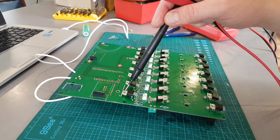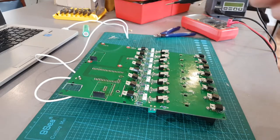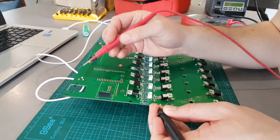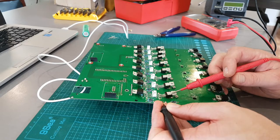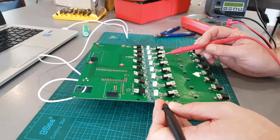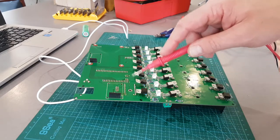Test from ground to the top middle here - because that is your drain pin and the source pin is the ground plane. Connect this up to the negative, and it should be two seconds on, two seconds off on this one. They're all working. If you didn't get the beep from the MOSFET, you can still go to the ground, and on these, the pins are gate, drain, source.